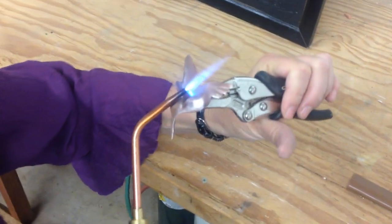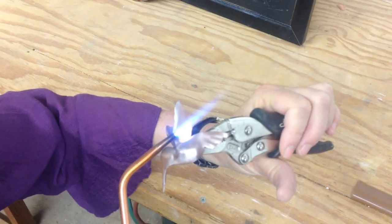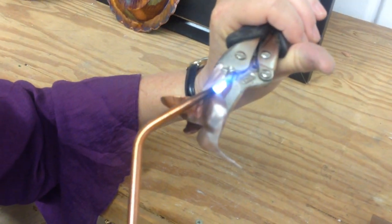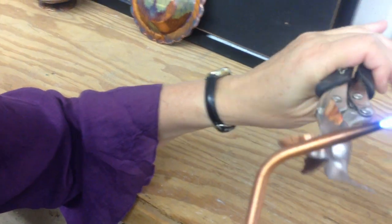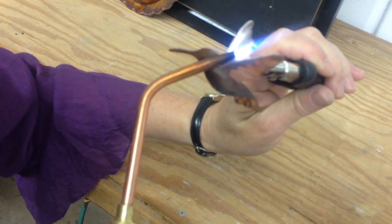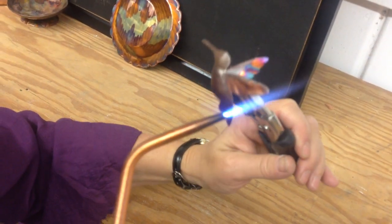So I'm going to use a reduction flame for the next step of the procedure. As I lay this flame, which wants oxygen, up against the metal where I previously stockpiled oxygen, the flame removes the oxygen from the preceding layer of oxidation and takes it right back down almost to the native copper. Basically I'm clearing the area that I want in color and leaving the rest of it masked to color in a consecutive layer.